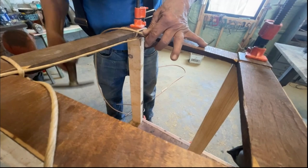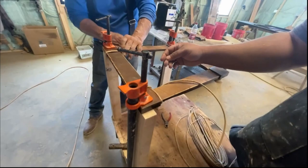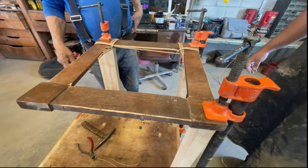Here's a good shot of how the weave is applied. I'm going to be freezing the video so it's easier for you to follow along. First, he's going to nail down the beginning of the weave to anchor it into place. Now you can see that the strand is laying on top of the bar to the left. He's going to loop it under the left bar and then over the bar closest to him, making sure that the strand is tight and firmly against the previous strand. Then he's going to hand me the strand. I'm going to pull it to the opposite bar closest to me, go over the bar and loop it under, then over the bar to the left. We will be doing this over-under process throughout the entire seat.